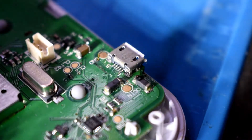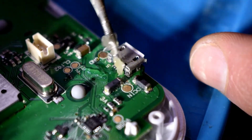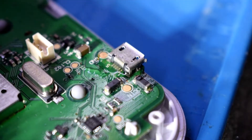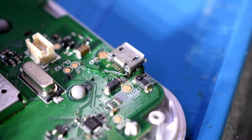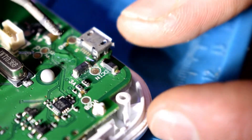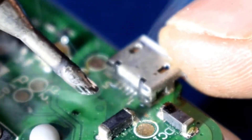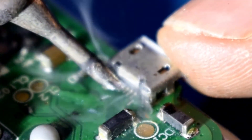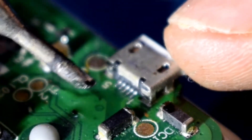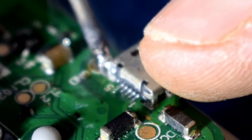Now that it's flush, it's time to solder the pins. I'm putting some flux on the back for those pins. The really important pins are the outside ones — they'll be positive and negative. The two middle ones are for sending data, but the data lines are not connected on this PCB so it doesn't matter. Just heating up those pins so there's a contact. Use a fan if you're using flux because it is hazardous. I'm soldering the sides to make a stronger contact, and there we go.